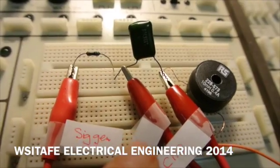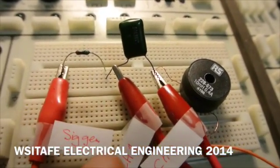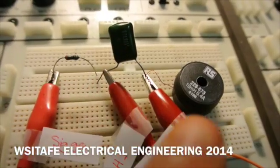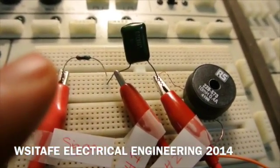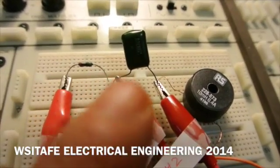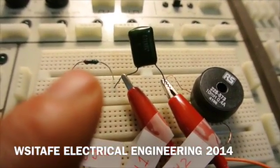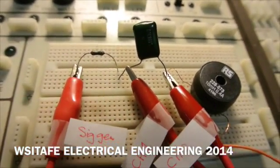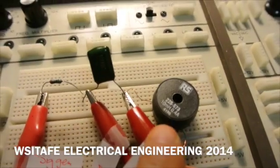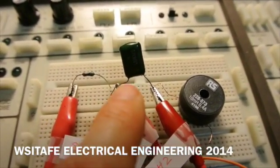Channel 1 is connected to the capacitor. Channel 2 is connected to the top of the inductor. So channel 1 is at the top of the LC series circuit. The signal generator comes in to the top of the 100 ohm resistor. Any short circuit developed at the resonant frequency across the capacitor and the inductor will cause a voltage drop across that 100 ohm resistor. I've used a 10 millihenry choke — a 10 millihenry inductor — and a 0.18 microfarad capacitor.